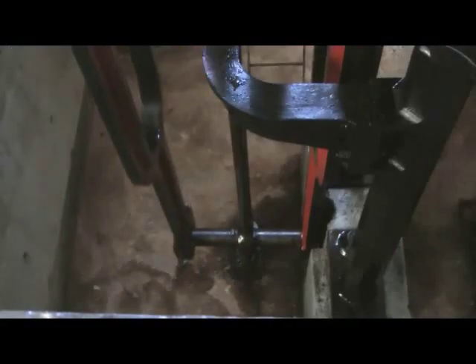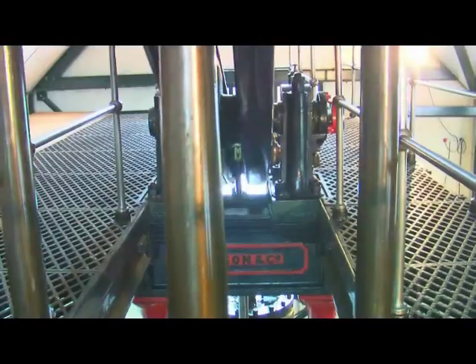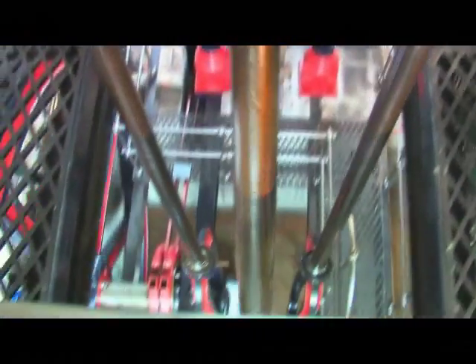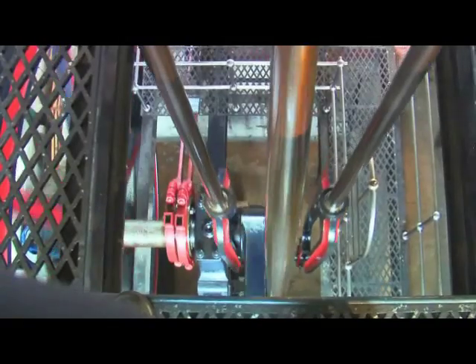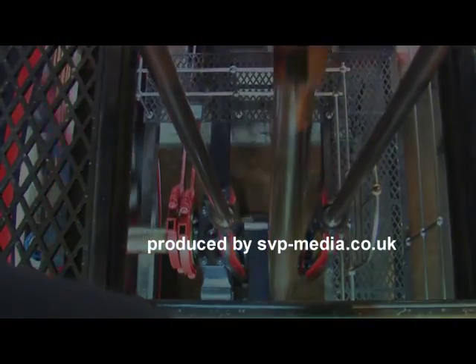The water side of this engine — the pumps were connected to that yoke system, just opposite the flywheel, and it had pitch pine shaft sections, nine inch square, about 20 foot long, all bolted together, going down 400 feet to the bottom of the well. And in the bottom of the well, you have a simple flat valve which just opens and closes, so the water comes up in stages and then just tips into the reservoir.